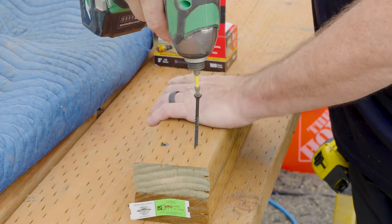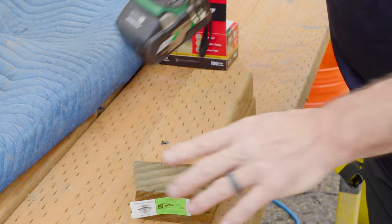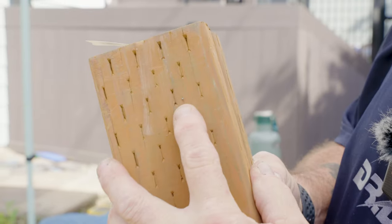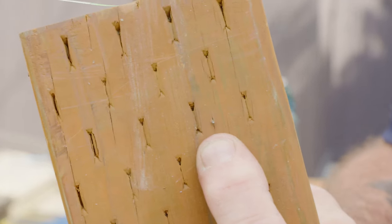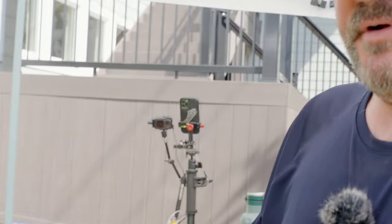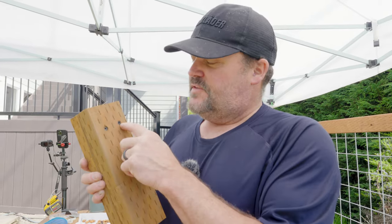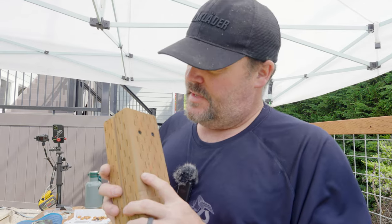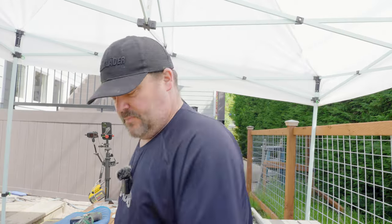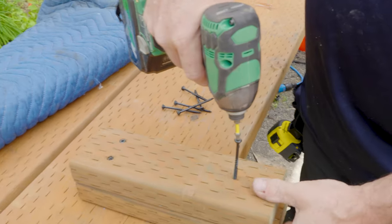Okay, there's flush — they bite pretty good. There's a little below flush, and you can see the tip of that screw is just getting ready to pop out of the bottom of the board. That's what I was getting at — if you're going to be doubling up a two-by-four, you might consider using a half-inch less length. This flush one didn't poke out, but it's almost about to, and the other one is in a good eighth of an inch and starting to poke through.